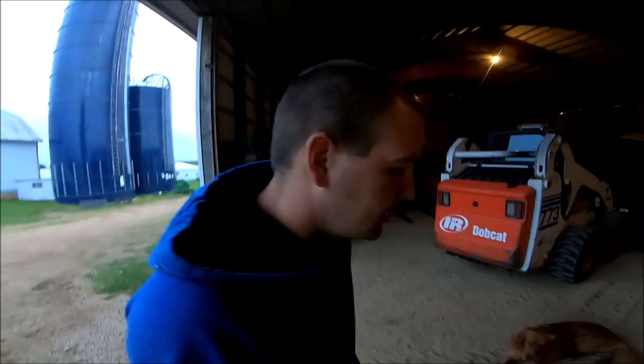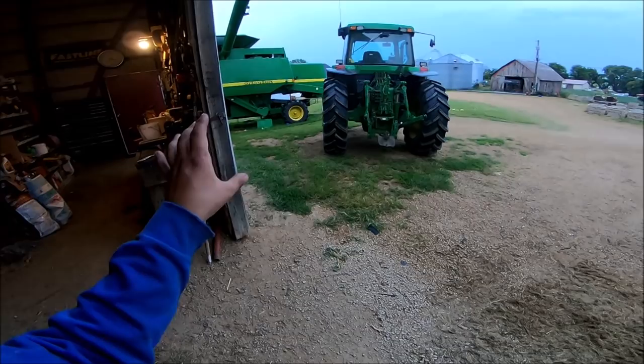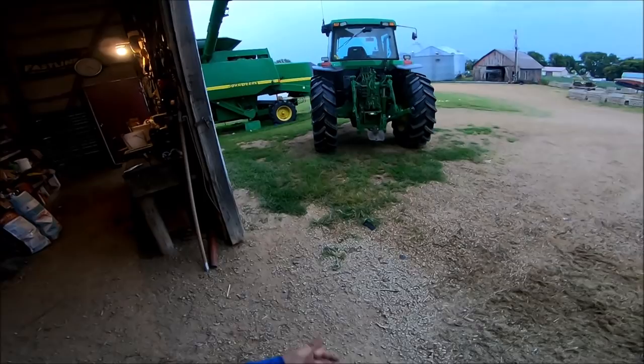The tedder did need a little bit of work — it's not really the tedder's fault. I took the tire over and had it worked on. Ryan somehow managed to get a pinhole on the face of the tire. I thought he just broke the bead, but all it was is just a tiny little hit — maybe a locust needle or a stick. That's a cheap fix. The 7600 tire was about $350 — a Michelin tube plus the patch they put on the inside. It's actually worked really well; we've run it two days so far.